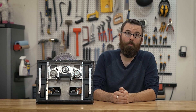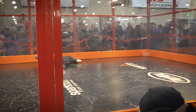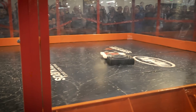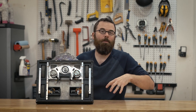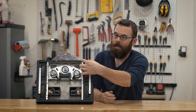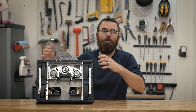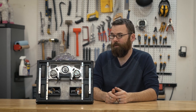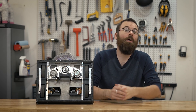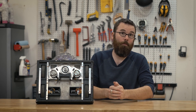The other thing I wanted for this robot is invertibility. I wanted it to be able to drive normally and also upside down just fine, which actually happened in the competition, and it was really nice that it was able to drive upside down. And lastly, I wanted the whole drive system to be basically shock mounted and isolated from any hits to the chassis. That's why the UHMW pods house all of the drive components and they're kind of isolated from the rest of the chassis, so I don't have to worry about a big hit going directly into the motor and shattering things.